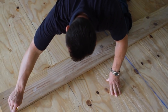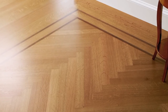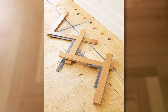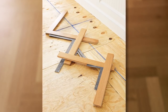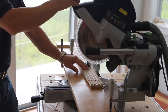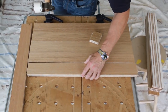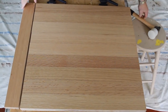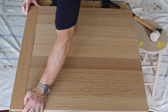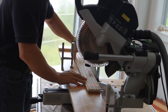To create the rectangular border you need for your parquet, with herringbone the slats need to be a length that's an exact multiple of their width. To figure that out, dry fit various lengths in a zigzag pattern to find one that will end evenly at the sides of your border. Then set up a stop block on your miter saw and cut a test slat to length — just make sure to cut off the end with a tongue. Double-check your slat length against a group of other pieces, make sure they're all pressed together tightly, and check that the test slat is flush with the edges of the grouped pieces. If not, make another piece and try it again. Once your slat length is dialed in, cut all the slats you need.